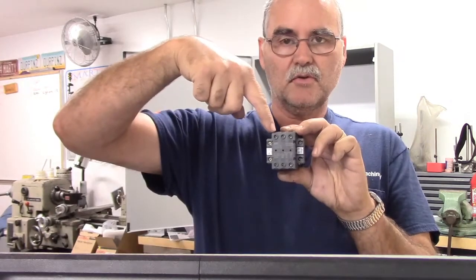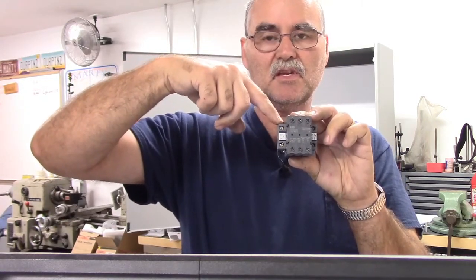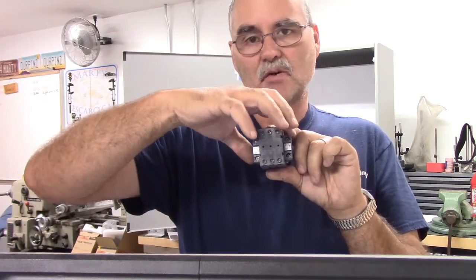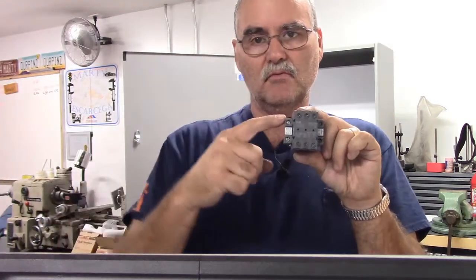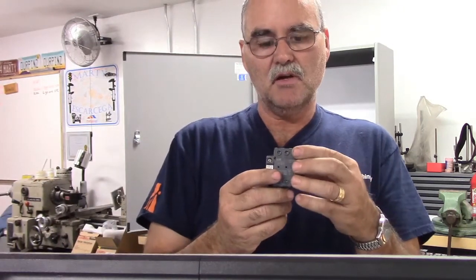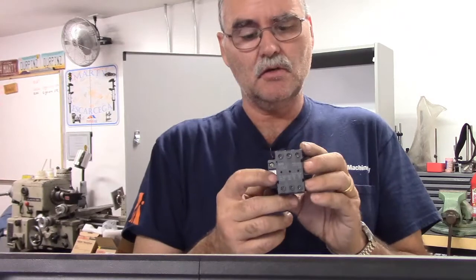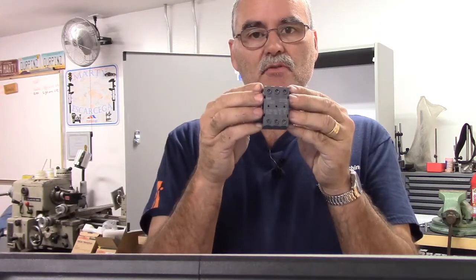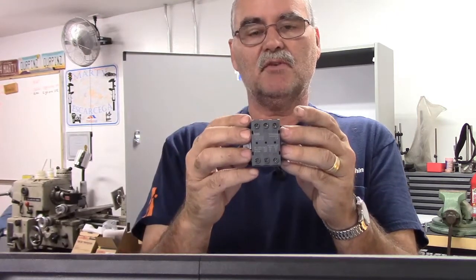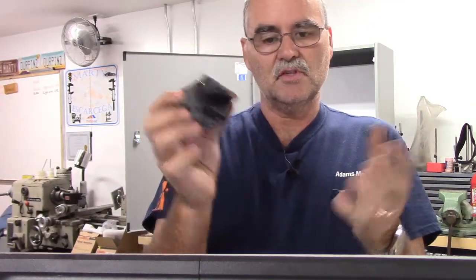So we'll bring 240 volts into the main part of the switch, and then we'll run the single phase on the other side. You don't break, at least I don't break, neutral circuits, so the 120 volt hot will come on one side and go out the other, and this will be a spare, and then there'll be a spare on the relay. I bought it off of eBay, so that's the way it's configured. Technically I could have gotten away with just the 3-pole switch, and I go at 240 volts on one pair, and I could put the 110 volt on the other contact and be just fine. But it's there, we'll use it.